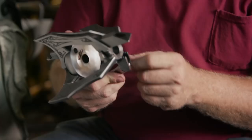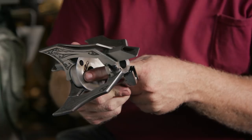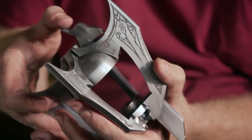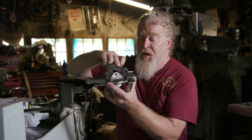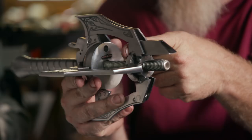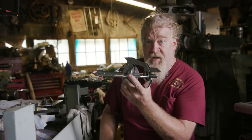Now we have our hammer functional and our spring in place. The entire piece is put together — the cylinder which sits in here has been painted and engraved. When it closes up, it'll lock that in place. This is a retaining bar holding our spring. To set the power and make sure we can strike it hard enough, we've shortened the spring, reached down and pulled it through. The hammer is on a pivot that's part of the handle — that'll come down, strike our cap which has the small charge in it, set off the charge in the chamber, and the powder inside the rotating cylinder is then forced out the end and should blow a big puff right out the front. The draw bar goes down the center all the way through — that's what locks the blade in. Everything should function the way we need it to.